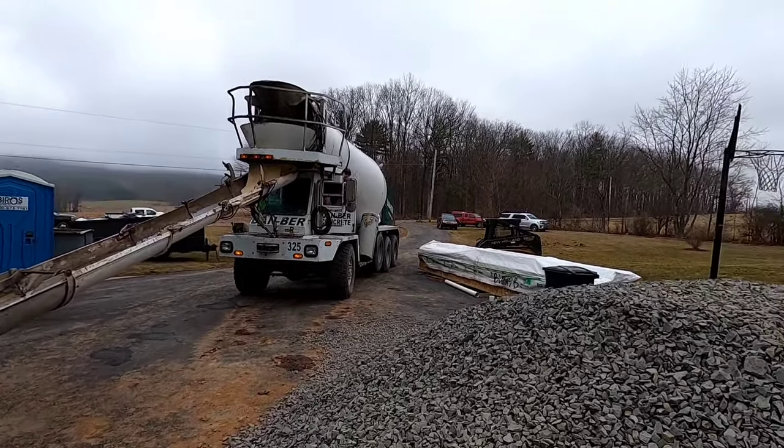Forms are off, Jake's scraping the last one — just gotta unload the trailer when we get home. The final step of footers is always to fill in the middle here with gravel, and the homeowner's gonna do that. There's the gravel — it's gonna go in the hole and then we can put our block down. Next video I'm gonna lay out where the corners go, build the block corners and leads, and a couple more videos on doing block, so stay tuned.